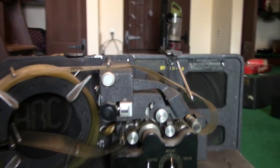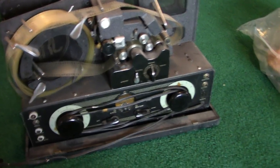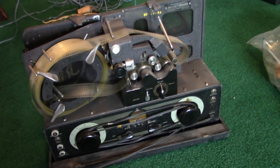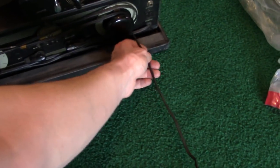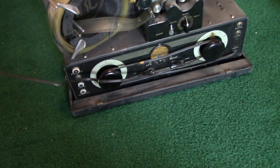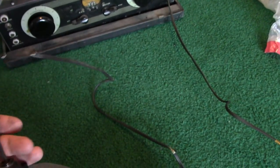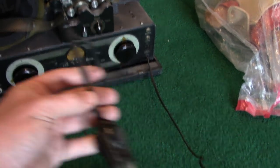If we look carefully in the transport mechanism, you can see a needle aiming down onto the film at an angle — I believe that is the recording needle. This piece here can move freely, and that would have the playback needle on it, but I think the playback needle is broken off. The downside is that it's gone; the upside is that a regular old cartridge for a record player would work as a replacement. If the recording needle were broken, that would really be a problem. I found online that these machines were used to record the D-Day invasions and the Nuremberg Trials.